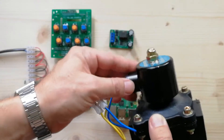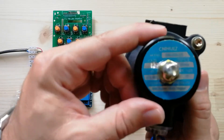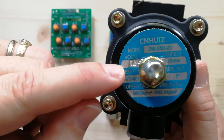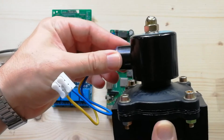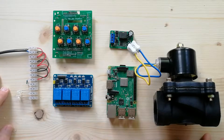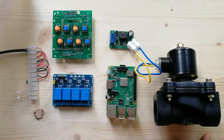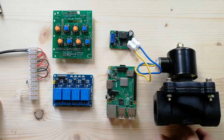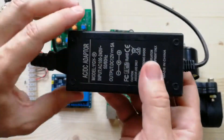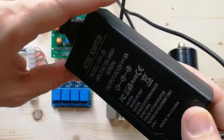Normally the big valves like this are 24 volts DC or AC, but I have seen that for the same price there is also a 12-volt version — you can see here, this is a 12-volt valve, exactly the same as the 24-volt except for the different voltage. I prefer to use 12 volts because the power supplies are cheaper. The 12-volt is commonly used for LEDs, so you can get a better deal, and you don't need a big power supply to switch on the valves.